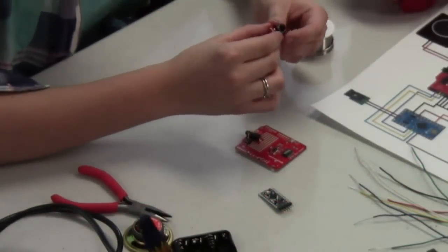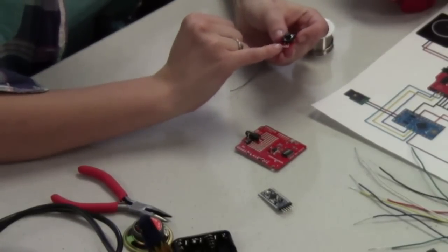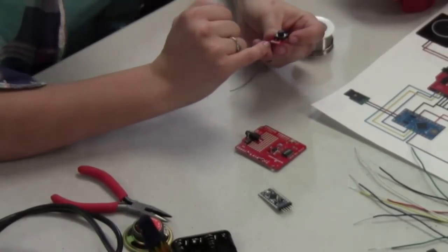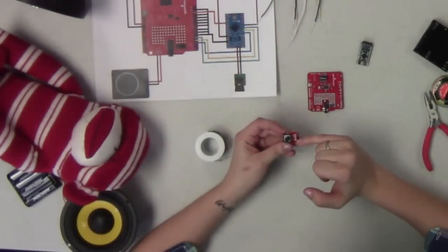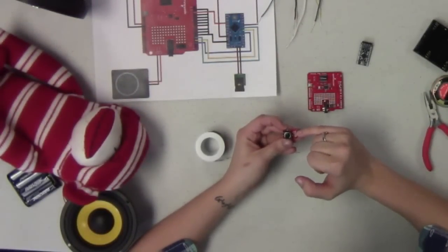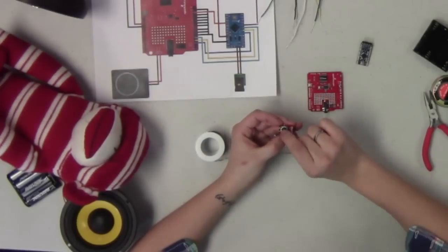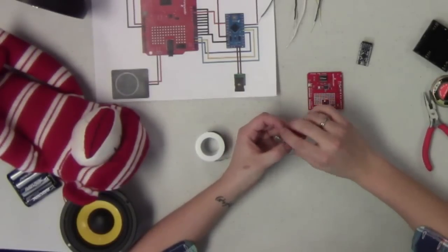All right. So now that we've got that hooked up there, again, we're only going to be using 2 of these pins on this breakout board since we don't have the LED in the push button. So we're not going to pay any attention to these pins labeled C and A, but B1 and B2, those are our button leads basically. What happens is when we push the push button, it actually ends up shorting those 2 pins together.